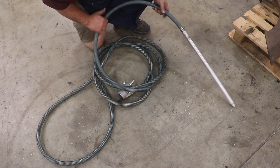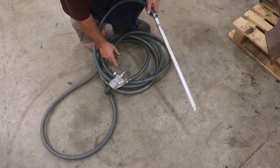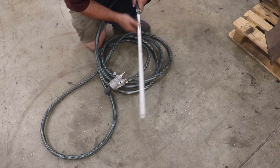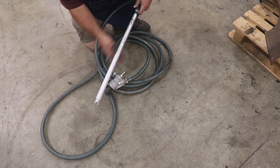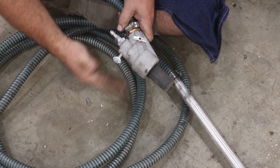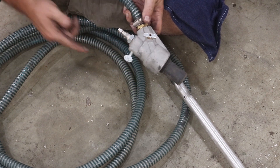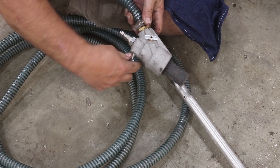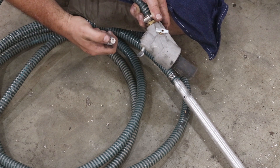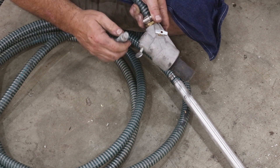Here you can see what we got. This is the main part right here, and this is a Venturi. It goes to a tube — this is just a suction tube. You stick this down into a bucket of sand and it suction-sucks it up into the sandblaster head. So this part of the rig is really what does most of the work. This Venturi basically creates a vacuum. You've got your pressure washer tip — this just plugs right into your pressure washer. There's a zero-degree nozzle in here.